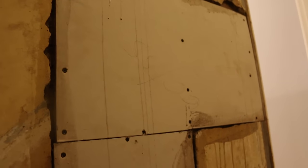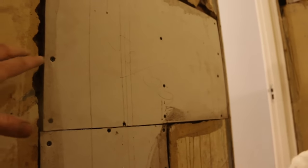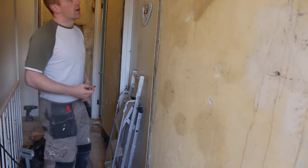The boarding down there is where the plaster is coming away. I've just got offcuts of plasterboard left over from the last job, and I've used 9.5mm plasterboard here to bring it up almost flush. I've PVA'd around it as well, so in the morning I can put some bonding around that. I've got loads of patching to do around the place.